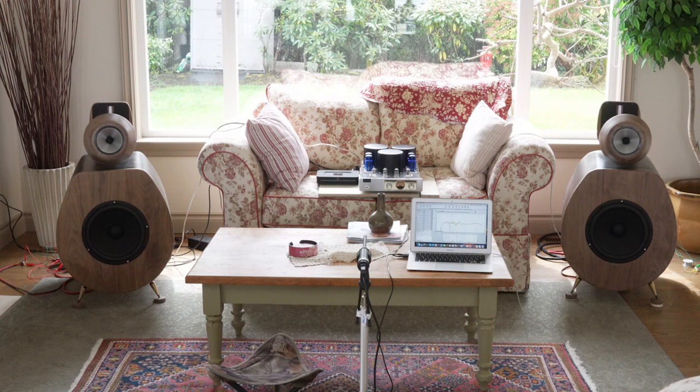I must have done over a couple thousand sweeps and measurements. The majority towards the end were done at the listening position. If you're designing speakers for yourself going in a particular room, measuring at the listening position — one speaker at a time — is what I like doing best. That's going to give you the best sound because after all, this is where you're going to be sitting. If you're doing speakers commercially, that's different — you'd use an anechoic chamber to get measurements that suit a whole bunch of people, not just yourself.